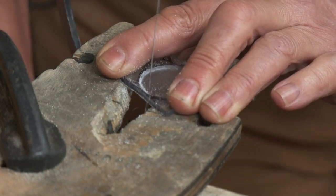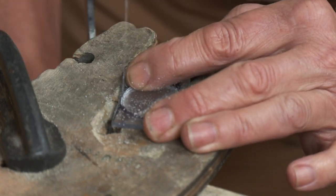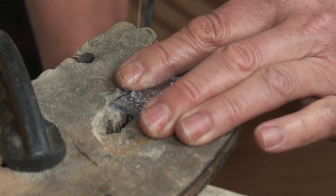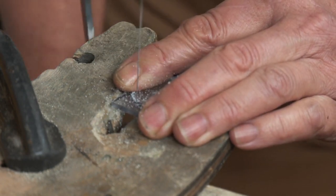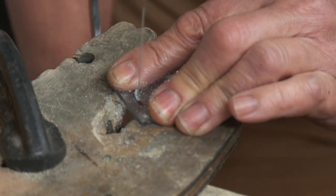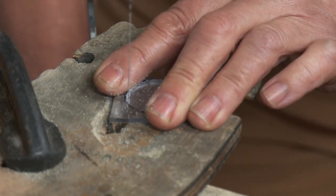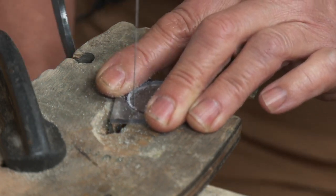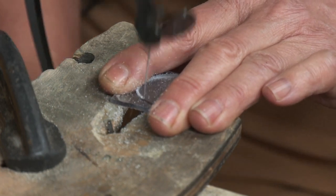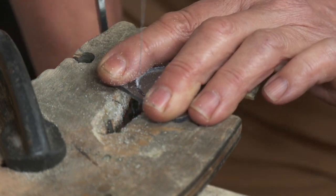Your right hand with the saw should not be tired. It's your left hand that has to hold everything in place that starts to get tired after a little bit. That's the way it should be until you get used to sawing all the time. I've got my protective plastic still on top of the plexiglass. I'll just probably use this plexiglass here, and you guys just be careful to follow the line exactly, because we're going to be setting this back into the space and it has to be a perfect fit. So you want to stay on that inside line.